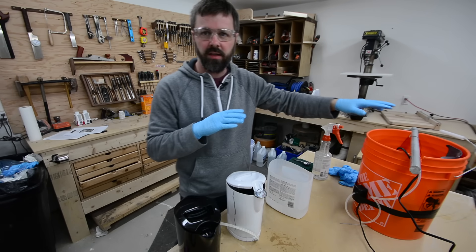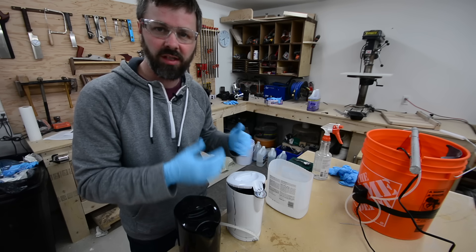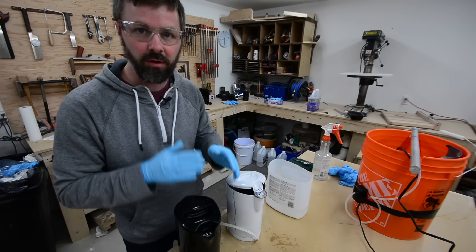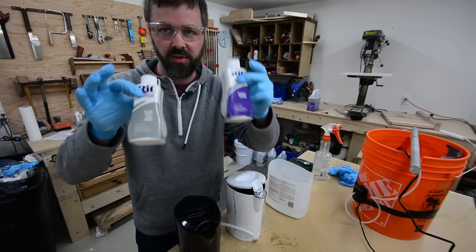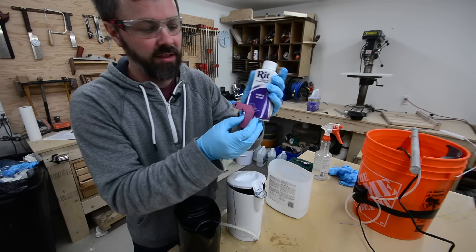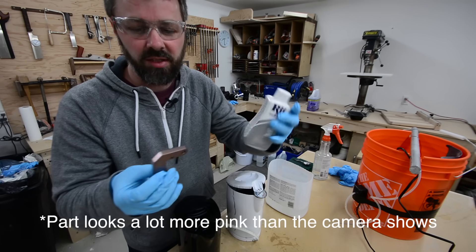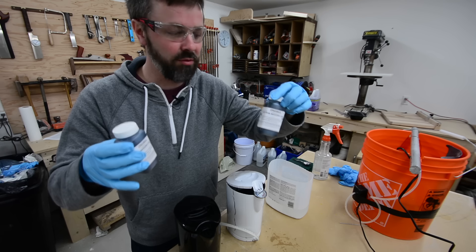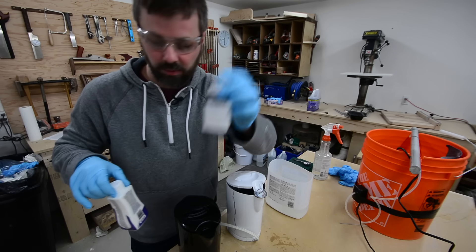So the anodizing process is all done. Now we're going to quickly talk about dyes. The dyes need to be heated up - about 140 degrees, though it varies from color to color and you've got to play with it to find what temperature that color likes. This green one, 140 degrees seems to work fine. The blue one I'm having a lot of problems with, but I get a little more success if I'm a little cooler. A lot of people use clothing-type dye - you can get it basically anywhere, and although it does work, the colors aren't super accurate. Like, that's more pink than purple, and this is supposedly gray. So the colors are hit or miss. The actual anodizing dyes from Caswell's do produce a better color - these are about 20 bucks versus 7 bucks for the clothing dye. I think it's worth the extra money.